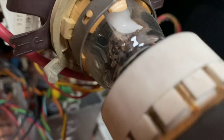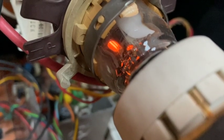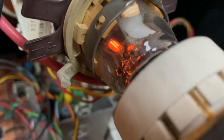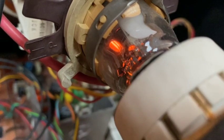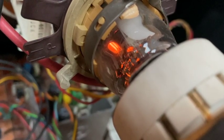and then the rejuvenation process starts. I would recommend watching the neck while the rejuvenation process is running. You will see the neck lighting up intensely, and after you see flashes coming from the filaments for a short amount of time, the rejuvenation device normally pauses the process for a moment. You can repeat this one or two times for each filament, and after that I think it normally should be enough treatment for the filaments.